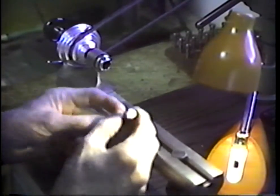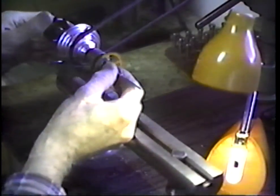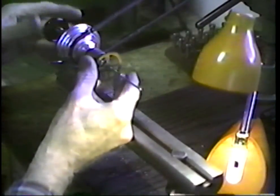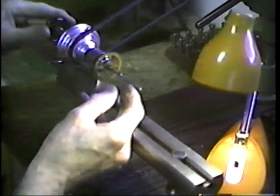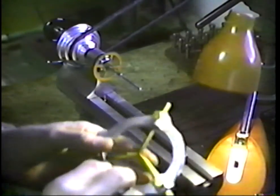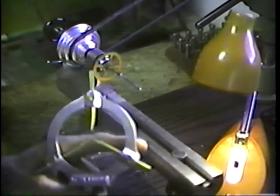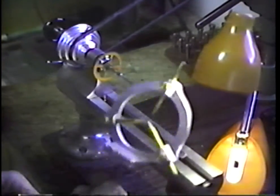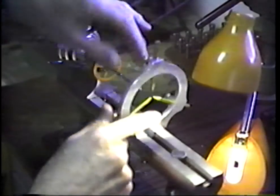Back on the camera, we've located a number 30 chuck that we are going to use for that. Slip the wheel into the end of the chuck, and let's see. We want to get this just as true as we can out at the point that we're going to support it, and then we will put the steady rest on it. So, back onto the lathe with the steady rest. As we place this on, we'll turn this to the outside because we need to get in close for this particular turning operation.